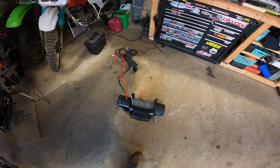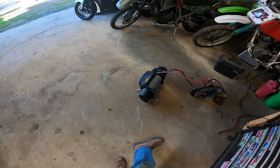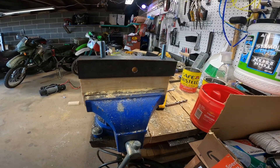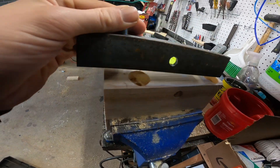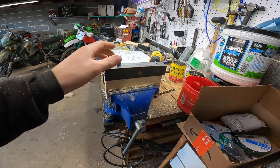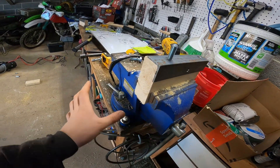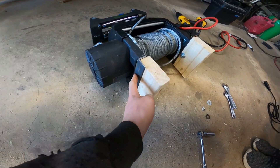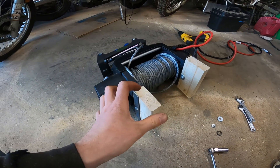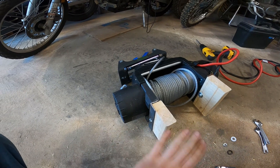Now I've got to work on how I'm going to mount the winch. This is a Tractor Supply Traveler 9000 — I've had this for a little bit. It will be fixed to the top but removed most of the time so it doesn't stay out in the weather. So this is what I've come up with: a piece of angle iron on a 2x4, with a through bolt going through the angle and through the 2x4 with the bolts recessed into the top. The only mounting point for the winch is through here and this will be screwed into the actual crane. You pull the bolt out and take the winch off. The fairlead cable will run through the middle and the fairlead will attach to the bottom somehow. A piece of angle iron bolted to the 2x4, attached to the winch, recessed bolts — this is pretty solid. It'll all be tied together.